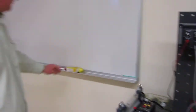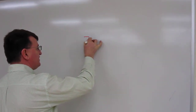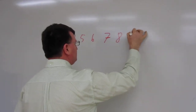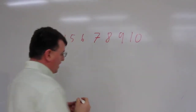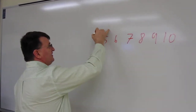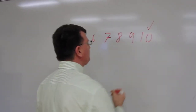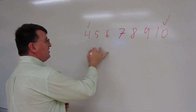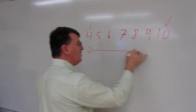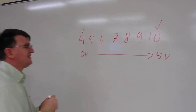What we're going to do — we know that the neutral pH is 7. So we have a scale: 4, 5, 6, 7, 8, 9, 10. I'm going to choose for my process — let's say this is my more acid condition and this is my more alkaline condition. What I want is a range from 0 to 5 volts that can represent that.